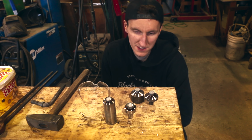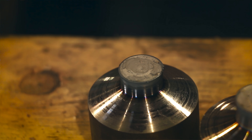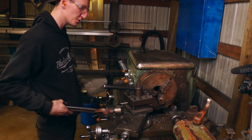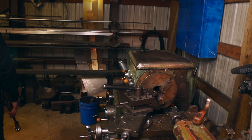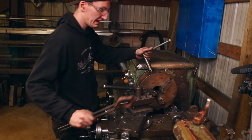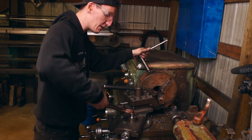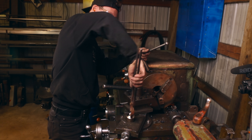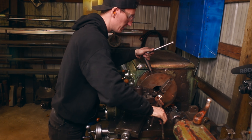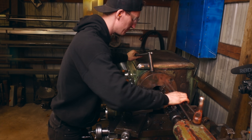I'm not sure on this one. I'm not sure if this weird grey stuff is non-fused material. This is the maraging steel, and I'm actually going to put it back in and try it one more time. I felt like maybe I didn't spend enough time when it was up at temperature to get a good weld. All I have to do is re-face this and we can take another weld on it, so I'm gonna do that before I 100% write this off.